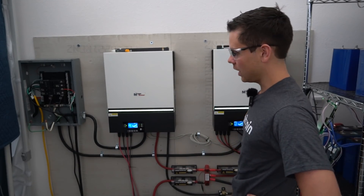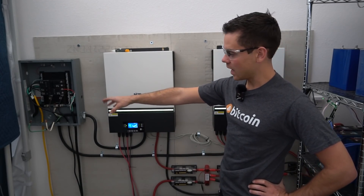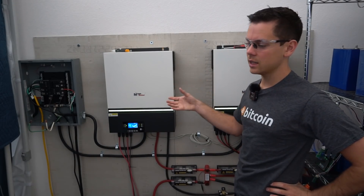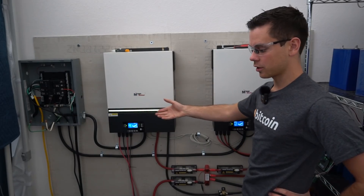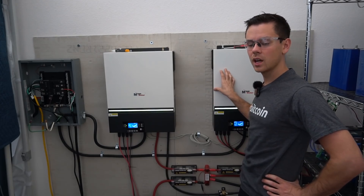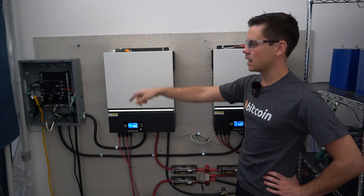Should we keep every ground separate on the AC output with its own bar for each inverter? I think that would be silly because you want a reference potential for all of the cases, and I think the AC output ground is the best way to do that. If you connect to an earth-grounded system, I would recommend only doing one inverter. Even if you have six inverters, only have one inverter connected to a true earth ground — that will dissipate charge accumulation for the entire system.